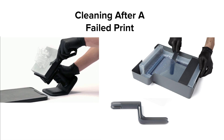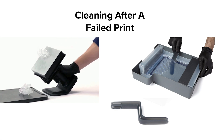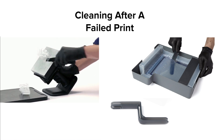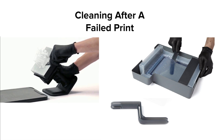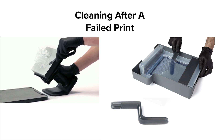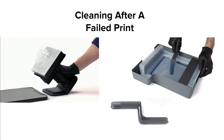Use the tank tool to inspect your tank, moving resin aside to check for adhered material. If there is adhered material — called a pancake — you can use the tank tool or a gloved finger to release the pancake and pull it out of the tank. Alternatively, you can run a cleaning mesh, which will print a mesh structure adhered to the tank. The mesh can then be removed as one piece, picking up any pancakes along with it. Never use the scraper, tweezers, or any sharp tools to remove print failures, as you could damage your resin tank.